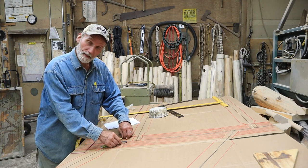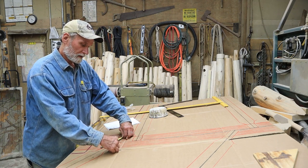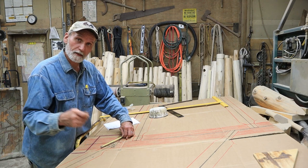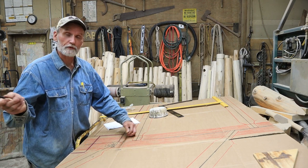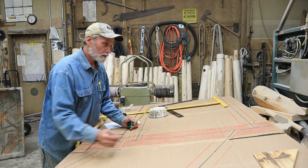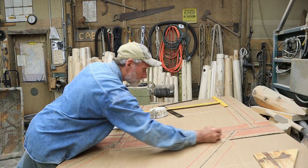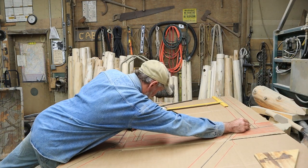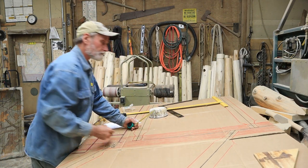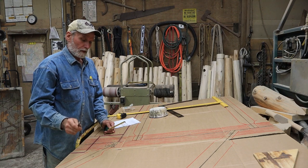But if you're working center to center, you can still, from that center point, figure how much shorter to make the handrail if you can only cut a tenon that's 2 inches long, or 2 1/2 inches. So you can figure it out. So 4 3/4, and 3 inches. So you can see the change here.